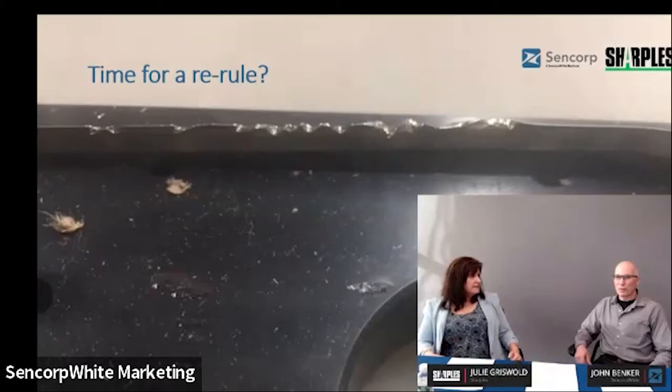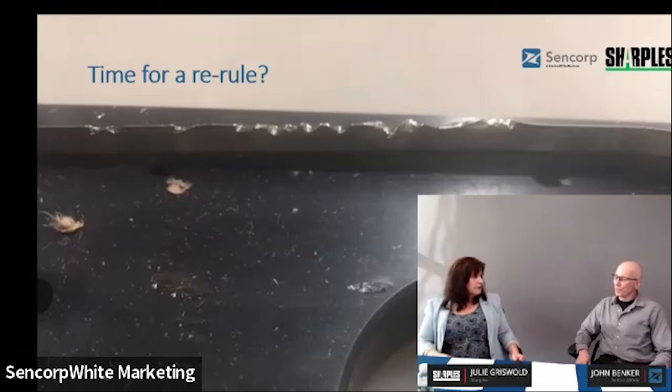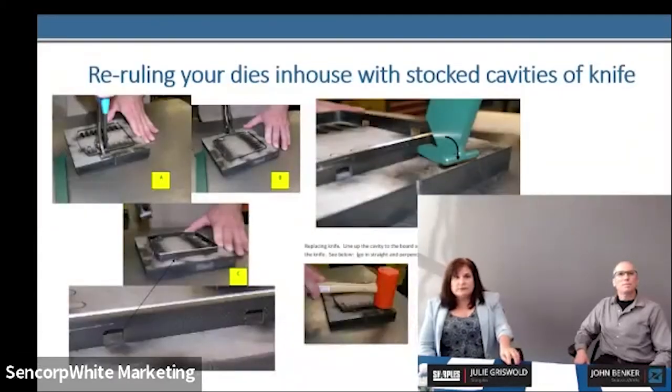The cut pressure is something to consider—the template we talked about means the knife has to settle in too. As you cycle through, maybe one, two, or three cycles, that knife needs to settle into its place so that it's properly flat. That doesn't mean you juice it up and crank up the pressure. Hit it at very low pressure in the beginning and slowly increase it. You might see inconsistencies in the beginning—some aren't just wear but just the die settling into place. Cut paper: some customers will actually cut through thin paper like make-ready material at three to five thousandths, and if you're just getting through, you can tell where your high and low spots are.